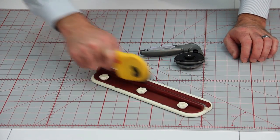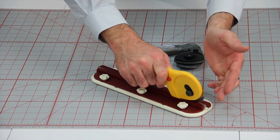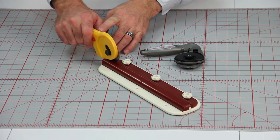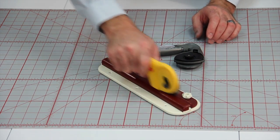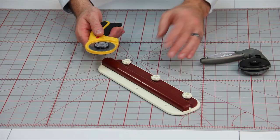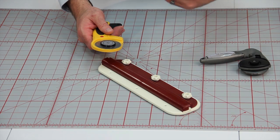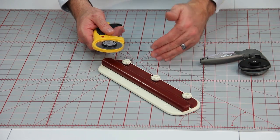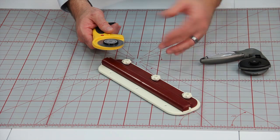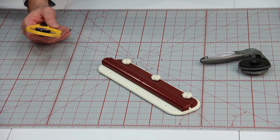And we're going to use the same process that we use when sharpening the 45 and the 28. What we do is we use the stone, we sharpen one side, we rotate the sharpener around. Again, we'll reinsert this back down inside of there, and we will now hone in the second side. Now, how this process is done depends on how dull your blade is. You're going to start with anywhere from 15 to 20 strokes the first time you sharpen a blade. We cut that in half. Whether you're doing 20, we'd go down to 10, or if we're at 15, for example, we'd go down around 7. We then would sharpen the blade both sides with 7 strokes, and then we would finish up again with half of that number, whether that be 5 or 3 strokes, and then we're going to try to cut to see how well and how sharp our blade is.